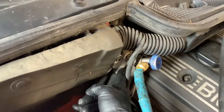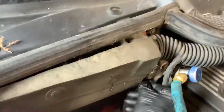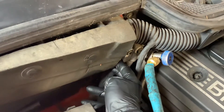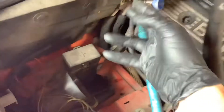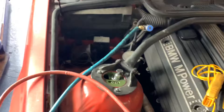Let's see. I put my finger on the suction line - I feel about 80 degrees. I'm giving you a rough estimate. I put my fingers on the liquid line and it feels like 68-70 degrees. Not sure - I'm using the back of my fingers, so it's uncalibrated. But the liquid line is colder than the suction line.